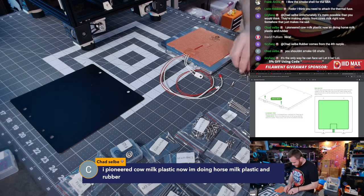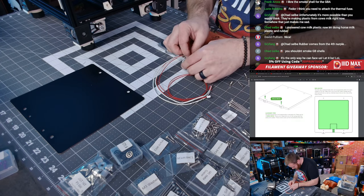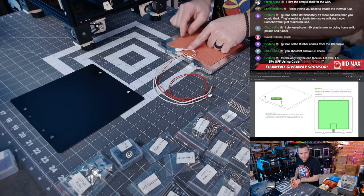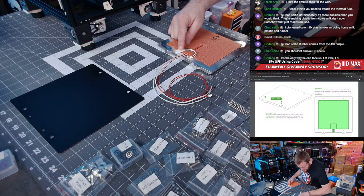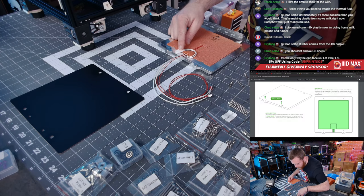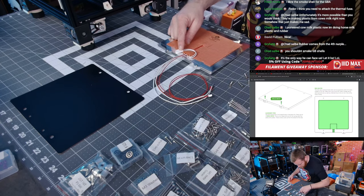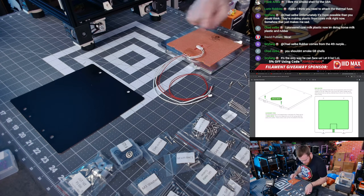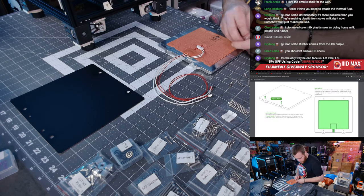What's up? All right, let's attach this guy. I'm guessing from what I remember, it goes here in some wild way. Like this would be perfect. And that is threaded. Let's see, which piece should I borrow here? I remember it has to be a socket head and not a button head. I do remember that from the Trident. The 16 would stick out too much, so we probably need an 8. M3x8. Let's see if that works. If it doesn't, we'll try a slightly larger one.